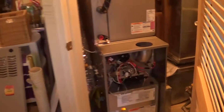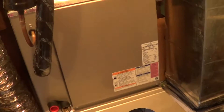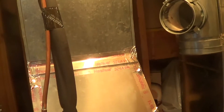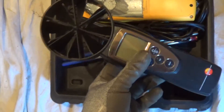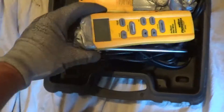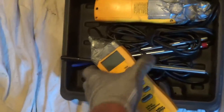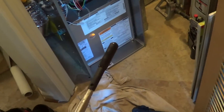So the first thing I want to check is airflow. I'm still putting the unit in, obviously. But there are a couple ways to check airflow — you can check static pressures, or you can use some nifty tools. These are great for vents, but I wanted to show this tool by Field Piece, which is the heated wire anemometer.